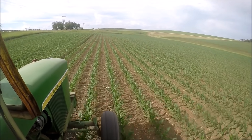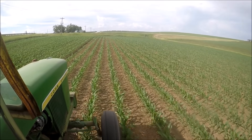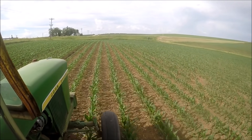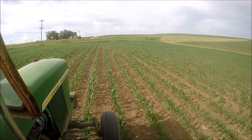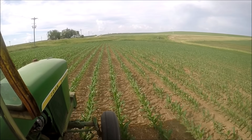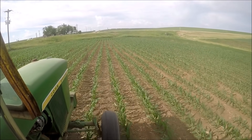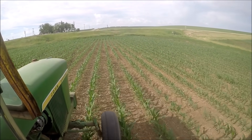My problems with the 4020 this year: the tires, and the wedges on the back end — actually the wedge on this side of the tractor — got loose and it was running down corn. It happened on the second-to-last day I was finishing up cultivating, and as the day went on I didn't realize it right away because the wedges were locked on there pretty hard. It didn't occur to me that's why it was getting so hard to cultivate around corners, because I literally had to drive straight without any room for error down the rows, otherwise I was running down corn.